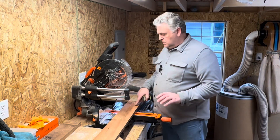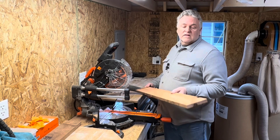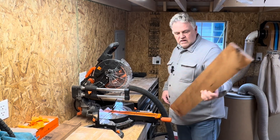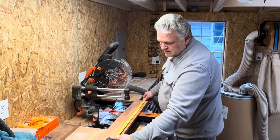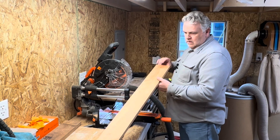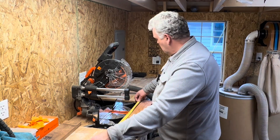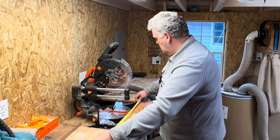My uprights need to be 28 inches, but this is a great time to take a look at the wood you're working with. This is some of that cherry from my last project. I've got a big gnarly knot right here that if I can get rid of, great. I've also got a little bit of snipe and a booger there too. What if I can take it right out the middle? I say we try it and see what happens. If I'm short, we'll alter the plans.